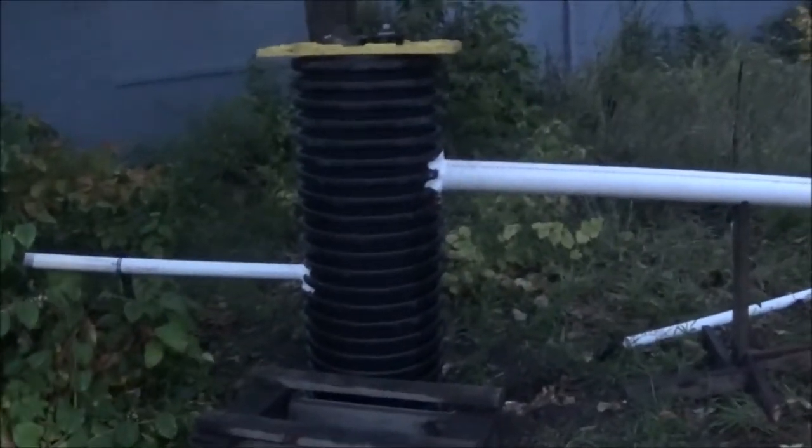also though, what I had to do, I didn't have a 3/16 weep hole in here when I just let it run out right here before I hooked it over to here. I had a cutoff here and just let it run on the ground here, but I wanted to get it further away from the building. But I put a weep hole right there at the highest point, because I know water is going to be inside this pipe. So therefore I don't want any hydro lock, so I put a weep hole right there. Okay, so now we got that done.